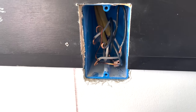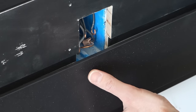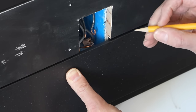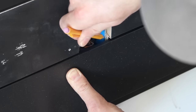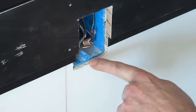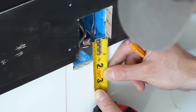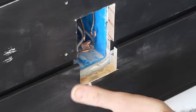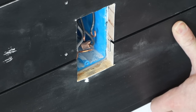For the bottom board around the outlet, the same rule applies — don't cut any farther down than where the drywall is cut. Hold the next piece up into place, mark the edges of the previous cutout, then mark inside the board where the lip will be. Measure down to the drywall cut, which is right at the bottom of the outlet hole — about 1¼ inches — and cut out that amount from those marks. Put it into place; it was cut out really nicely, pretty much perfect. Anchor it just like all the others.